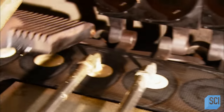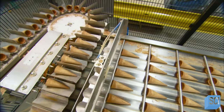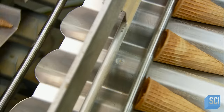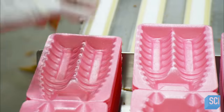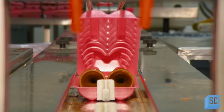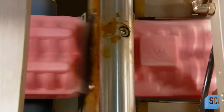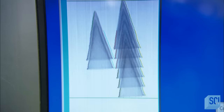Over in the sugar cone department, the baking plate system is designed differently. It makes patties that are fan-shaped and have a flat edge. This shape, along with a firmer batter, means sugar cones are stronger than waffle cones, so they're a more popular choice for hard ice cream. Packers stack the cones in styrofoam trays, then the packages travel through a curtain of high-density polyethylene film. A heated sealer finishes the wrapping job. An X-ray machine sends information about the contents to a computer that counts the cones and alerts inspectors to any problems.